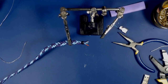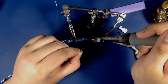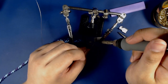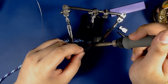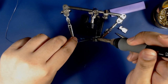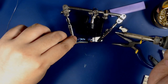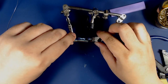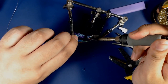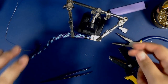I'm gonna clean up a little and head to my USB-A connector. Similar to the USB-C side — if you haven't seen this process before, definitely check out that DIY USB cable video. I'm just gonna tin our wires and tin the connector itself, then solder on the individual wires. If you want a reference, check out the resource linked in the description below. Make sure you have all your solder points in — thankfully since you cleaned it up and put the twist tie on, it should be fairly easy. All solder points are done and looking good.